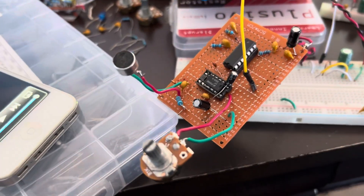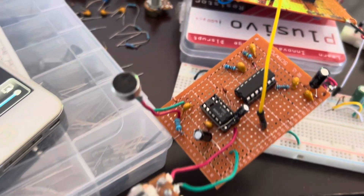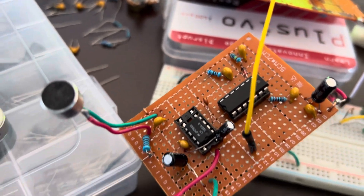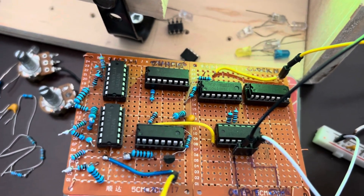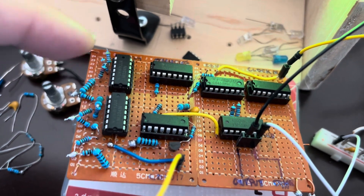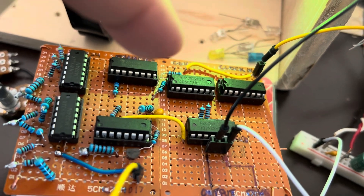This should be the final circuit — the sound microphone pickup board. There's a potentiometer here for the gain of the LM386 chip, and another op-amp that uses a diode for a peak detector circuit. The output through this yellow wire goes to all the processing, which uses two op-amps as an analog-to-digital converter, converting it to basically eight values. That gets processed and goes to a shift register that shifts it out.